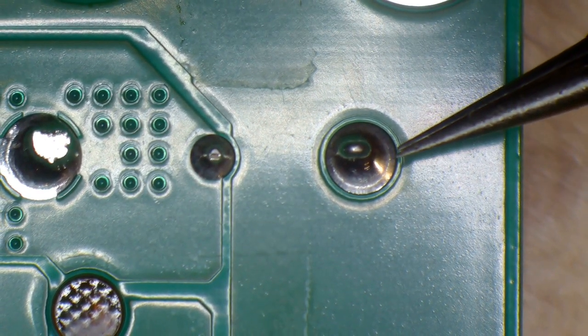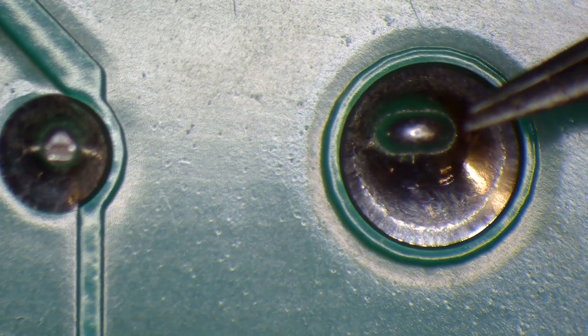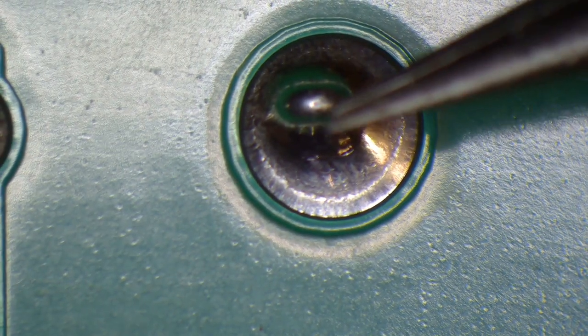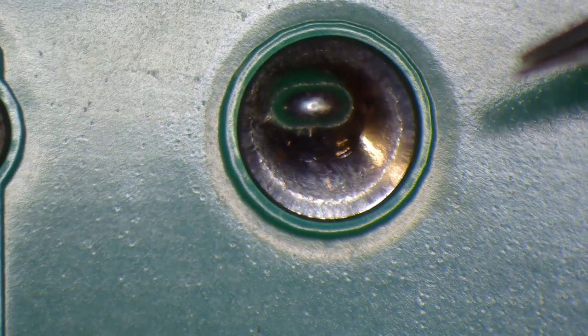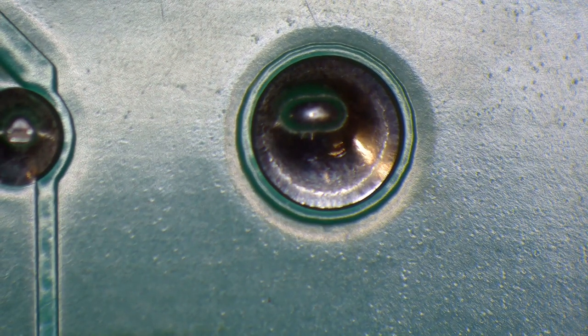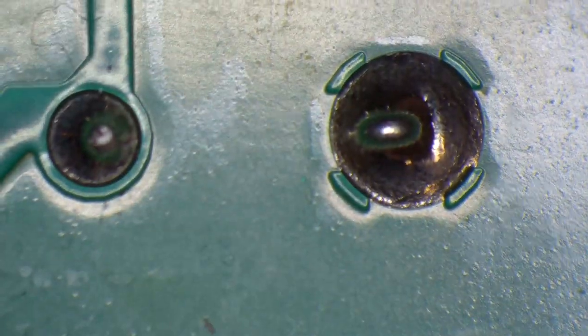On this side of the board you can see there are capacitors that come through to these points right here. You can see it's got some cracking — cracking around here. As we drill down and refocus, you start to see it more prominently: cracking around the pin and also out here. That's because these things heat up and cool down, plus there's vibration, and you get this cracking. There was one pin in particular that was worse than the rest.